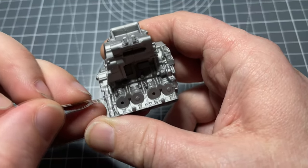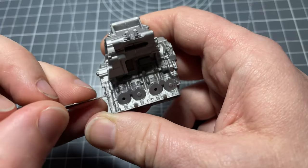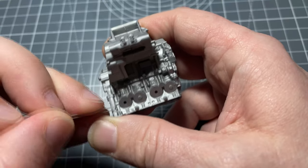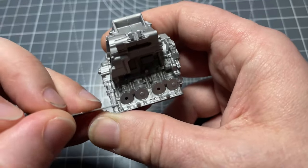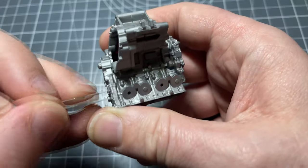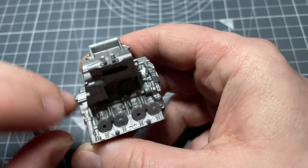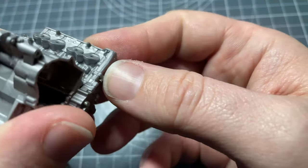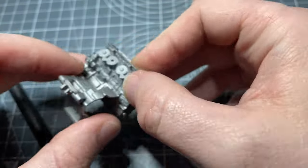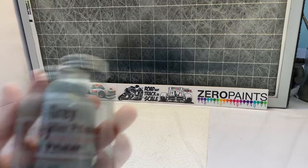But I have to make sure that the glue is fully dry, otherwise you're just going to spread it around to make even more mess, which you obviously don't want. So just carefully doing that, and same process as when you're sanding. I'm just looking for the lighter areas and the shinier areas to go, so that I know I've got a smoother joint. So it's quick and simple, and then do the same for the rest of it, and then onto paint.